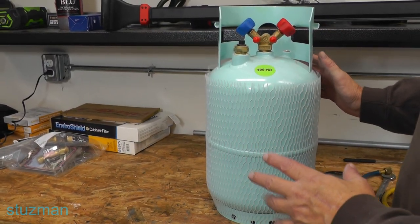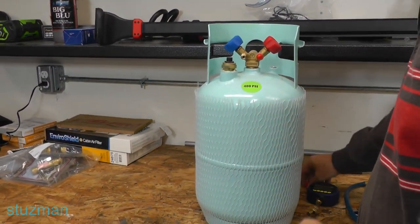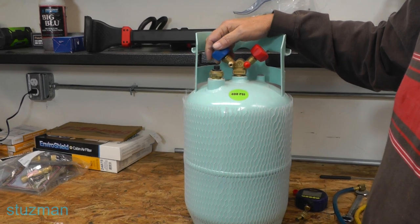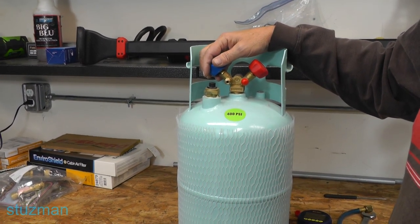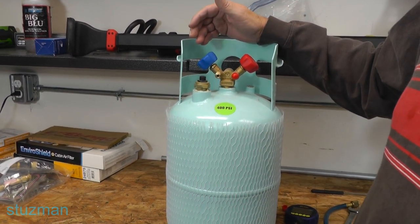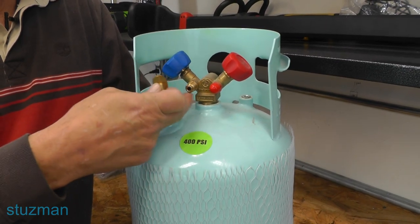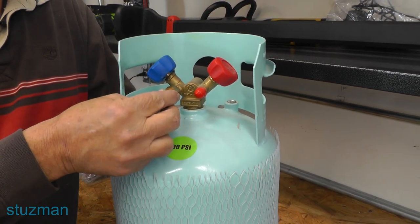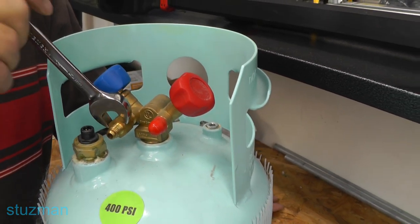Here's our recycling tank. When you buy a recycling tank, it's going to be typically filled with nitrogen. So we're going to take the plug off and let the nitrogen out. Now all of the nitrogen is out. Before we can put refrigerant back in here, we need to remove the air that's inside the tank. A hose from our refrigeration gauge manifold set is not going to fit on here, so we need an adapter — we're going to screw an adapter on there and snug it up a little bit.